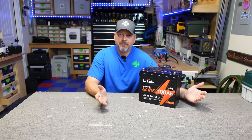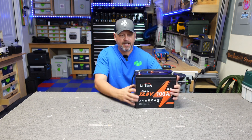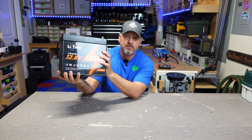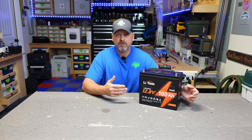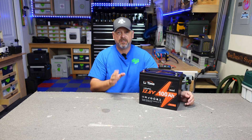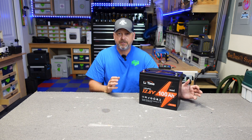Well gang, that's kind of it. There's nothing really much to these batteries — either they work or they don't work. Ampere Time slash LiTime has been around for a while; they're not some knockoff brand. It's a good battery. I hope I can convey how small this little 100 amp hour battery is. I have a feeling most batteries are going to have to go to this form factor because they're just so much more convenient — easier to move around, fit in smaller spaces. This one comes with a five year manufacturer warranty, and that warranty does hold value since the company has been around for a while. Remember, this doesn't have a low temp cutoff feature, so don't charge below freezing.